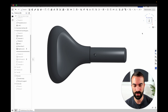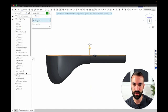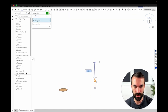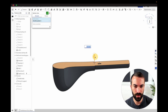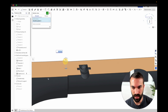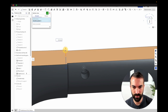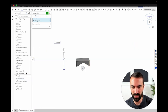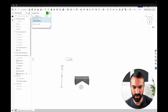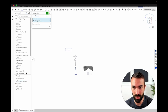I'm printing in this orientation. Sectioning it to show how the printing would work — as I print this part it starts there, there will be supports where needed, coming up layer by layer. Here's my hole, there's my nut location. I'm going to print right up before the layer bridges over the top, then pop in a nut and pop in this little support piece. It just hugs the nut and makes a nice flat top so that when printed over the top the nut is really secure inside. This support piece is generated automatically by the captive nut feature.